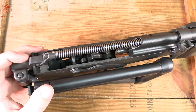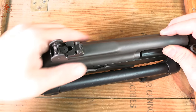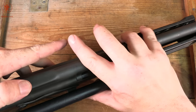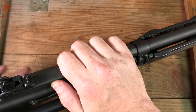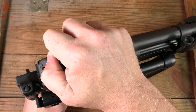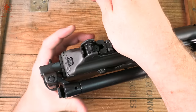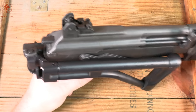The top cover is a little tricky because the tail is so long — it's almost easiest to start by hooking the tail inside the cover, then driving forward to make sure the lip is down in the little ridge. If you ever wonder why some things look so difficult when I do them, it's because I'm doing this at a 90-degree misorientation, looking through the camera down at the gun. The top cover fits very snugly. Make sure we're over the lip — give it a whack — now it's lined up. Work the bolt and that kicks the tail out to where it needs to be.